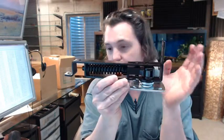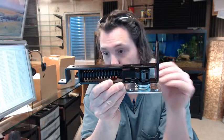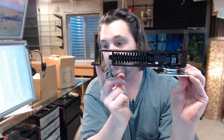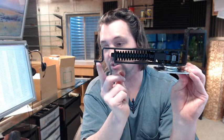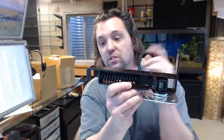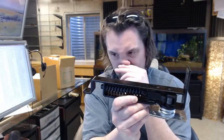We're in step 3 now. Look to the right of the top drawing in step 3. You see 5/32 from the floor to where the bottom of the door is going to be more. Forgive me. Start over. Bottom of the door to the top of this mortise is 3 5/16. Okay.